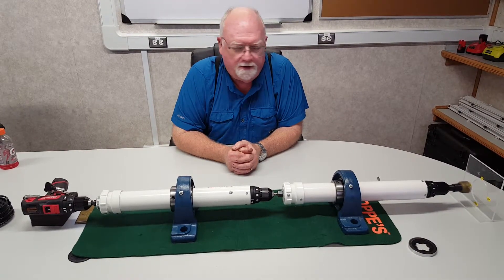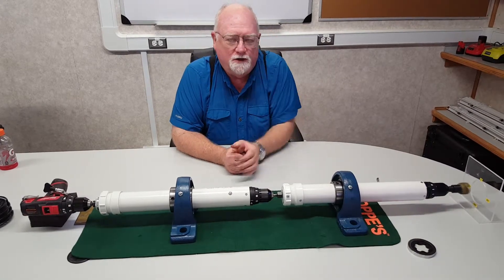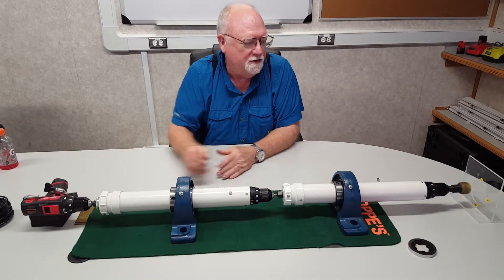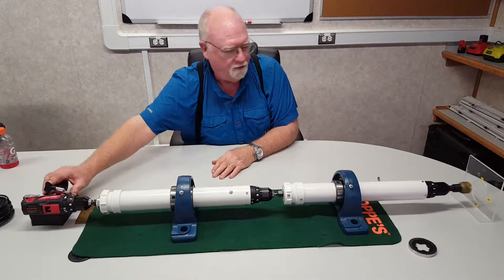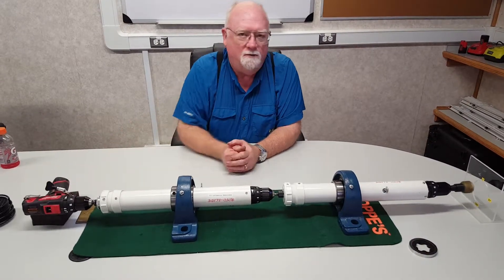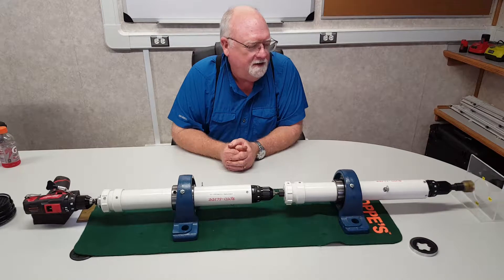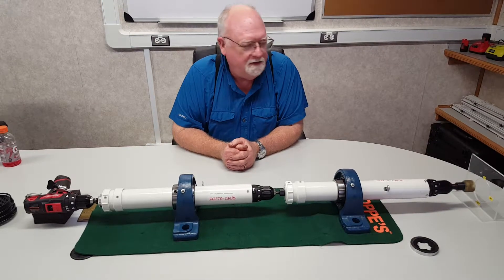The problem is, when I'm sliding, I have about 10% the rate of penetration that I would have if I was drilling full ahead. Full ahead — say 100 feet an hour — and in sliding mode, 10 feet an hour. Obviously, we would like to be at 100 feet an hour on a continuous basis.